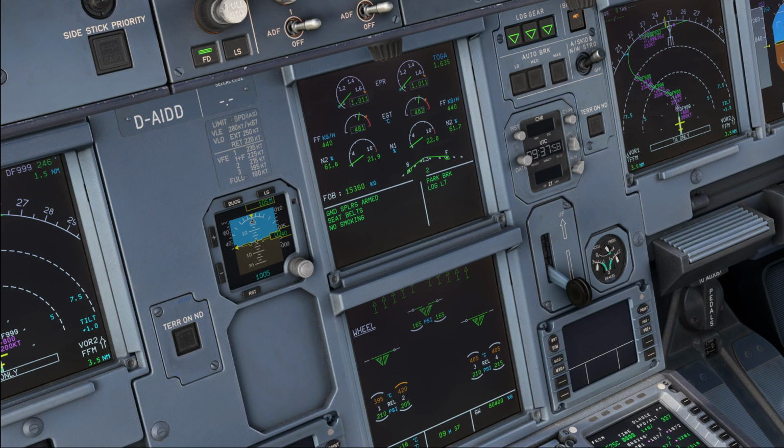Now, as you can see, we are still seeing an increase in the brake temperature over here, so now we should think about, are we going to use the brake fan or not? First things first, the Flight Crew Technique Manual advises the pilots that delaying the brake fan selection limits the oxidation of any possible transient hotspots of the brake disc surface. The selection of the brake fans before the aircraft reaches the gate prevents blowing carbon brake dust on the ground personnel, and the brake fans blow dust only during the first seconds of operation.